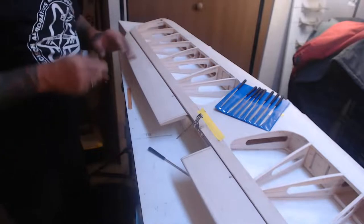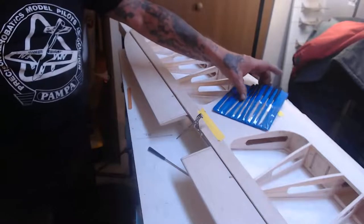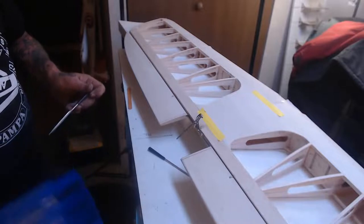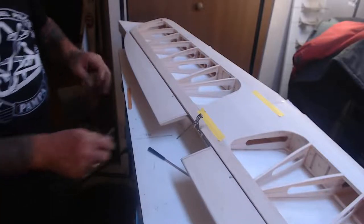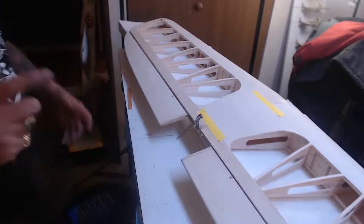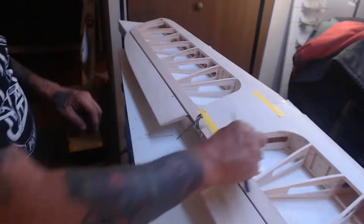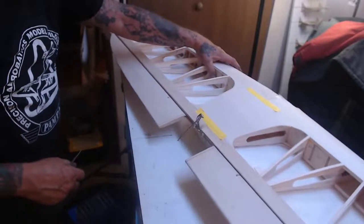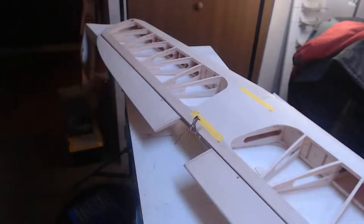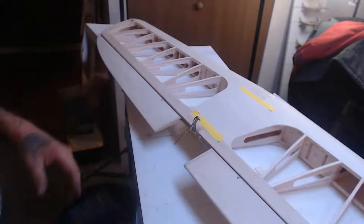Finish off that tip. I've got to ogle that thing out. Yeah, shoot. Half round file, maybe? Yeah, we'll do it with the file. Because of the shape of these flaps and how they work, you have to make sure that it's relieved at the tip. Let me turn this. Because they rotate in a knuckle.